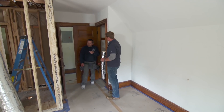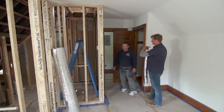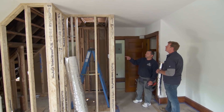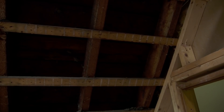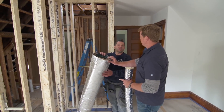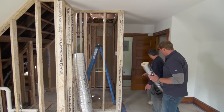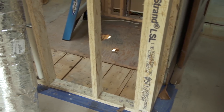The problem is getting the ductwork from one end of the building all the way around to the master bedroom on the other side. We thought about going up and over through the attic and then down, but the framing wasn't big enough — only five inches in the rafter bay — and the 7-inch trunk wouldn't fit, leaving no room for insulation, which means ice dams. Going through the floor was also considered, but we'd have to cut the floor and sheetrock out below, and we don't know if there's plumbing or future lighting in the bay. Once that 7-inch pipe goes in the bay, there's no room for anything else.